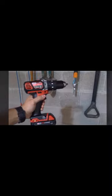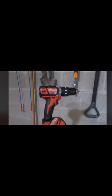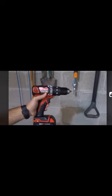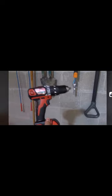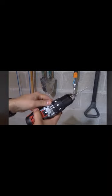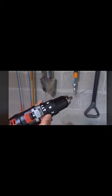How to use a hammer drill. In this video, we'll go over the basics of properly using a hammer drill, demonstrated with a cordless hammer drill — though corded models work in a very similar manner. This particular drill has multiple options: it can function as a driver, a regular drill, or a hammer drill. If your hammer drill has other options, make sure you have it set to the hammer drill setting.